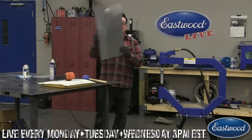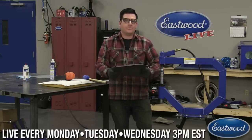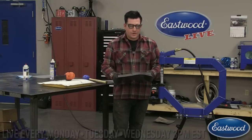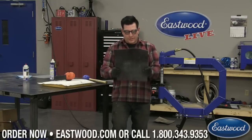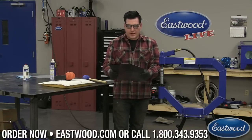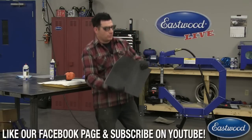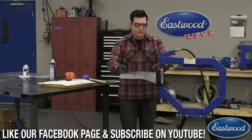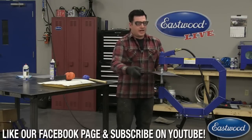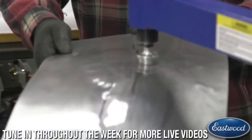So when you're using a planishing hammer, I'm not really putting any force down on the panel at all. I'm just letting it work. I'm just guiding it back and forth. With an English wheel, you can kind of put some body English into it and make it work a little faster. But with this, there's not much you can do. The only time I would really pull down or put pressure on it is if we were just following the panel. But otherwise I'm just guiding it along like this, and I just spray lubricant on it so it slides real nice, especially when you're planishing.